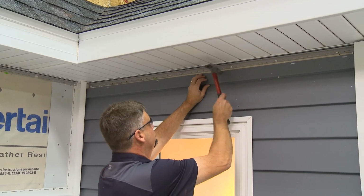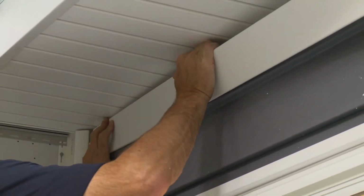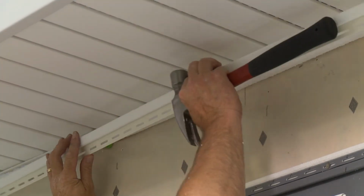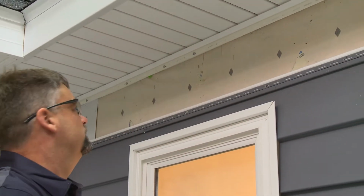When all panels are installed, cut finish board to size and install into cornice receiver using the palm of your hand as you go to help engage the locking leg of the finish board into the cornice receiver. When using undersill trim or dual undersill trim to secure the panel, shim the trim out to accommodate the thickness of the siding.